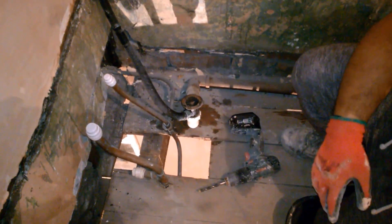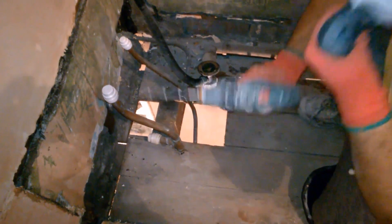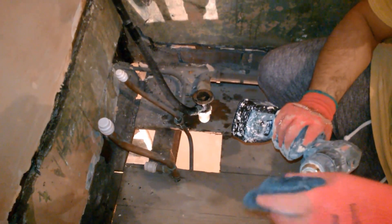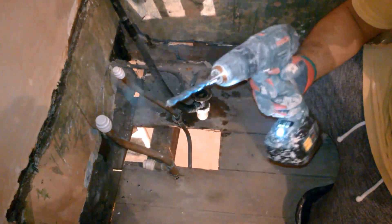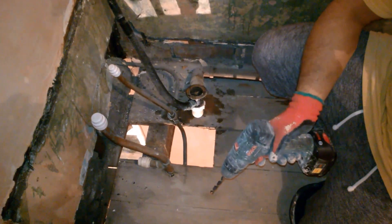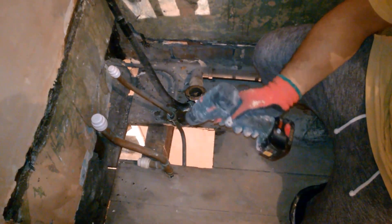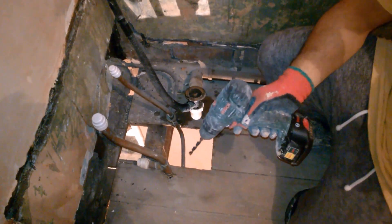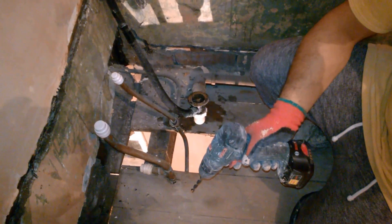Although the water is off anyway, what I'm going to do — I've resorted to this amazing technique I kind of came across. Most of you know about it, but basically using a drill to cut through it as much as I can, and then the rest I'll finish off from the bottom. This is repairing the joist, so I'm cutting it off so I can butt the new joist. I'll also show you how I kind of custom make a joist using studs.